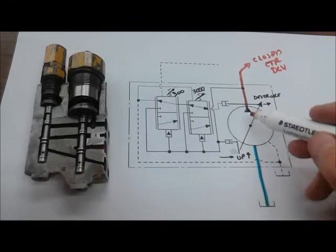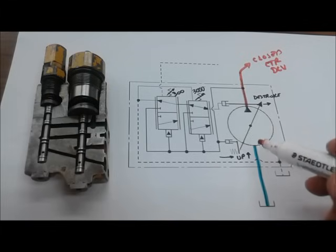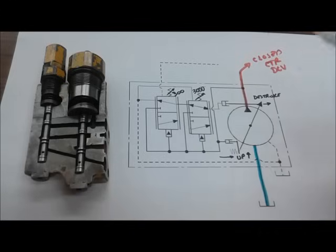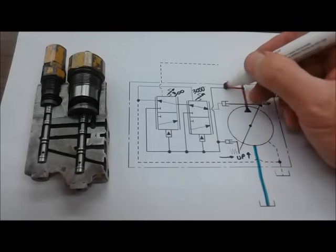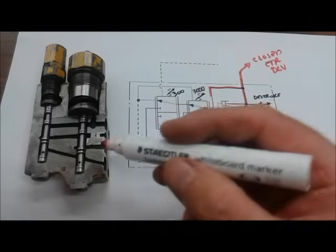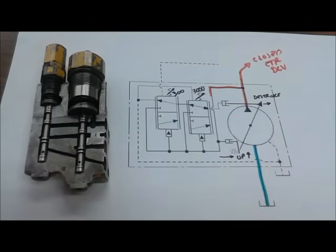So we're going to start up the engine. The pump's going to be at maximum displacement, pumping oil to basically a dead end, closed center DCV. So we know what's going to happen. Obviously pressure is going to begin to build here. Luckily it can come into the pump through this connection and be sensed